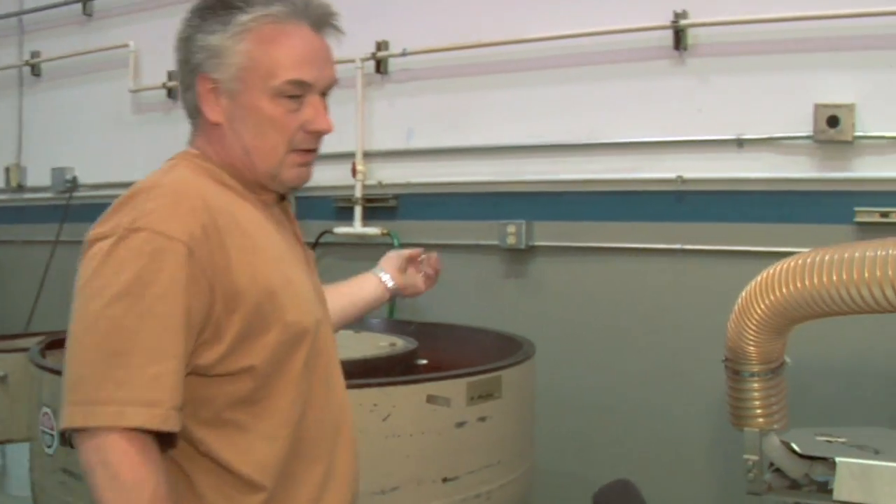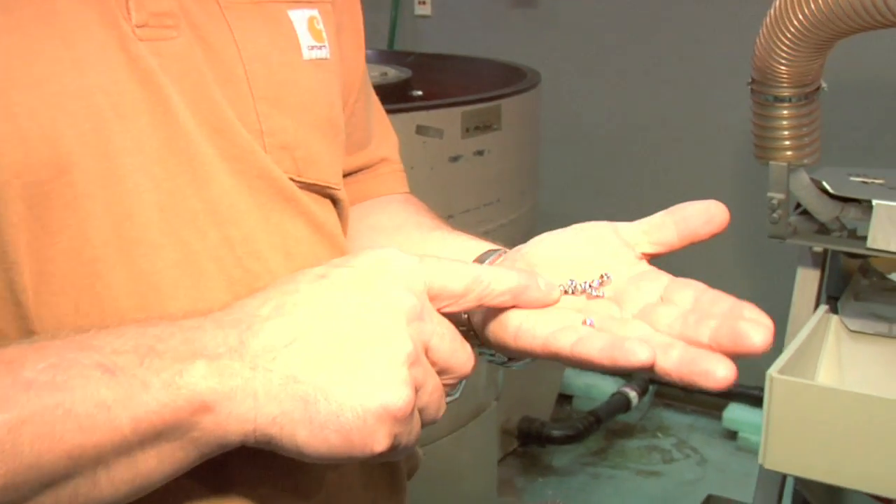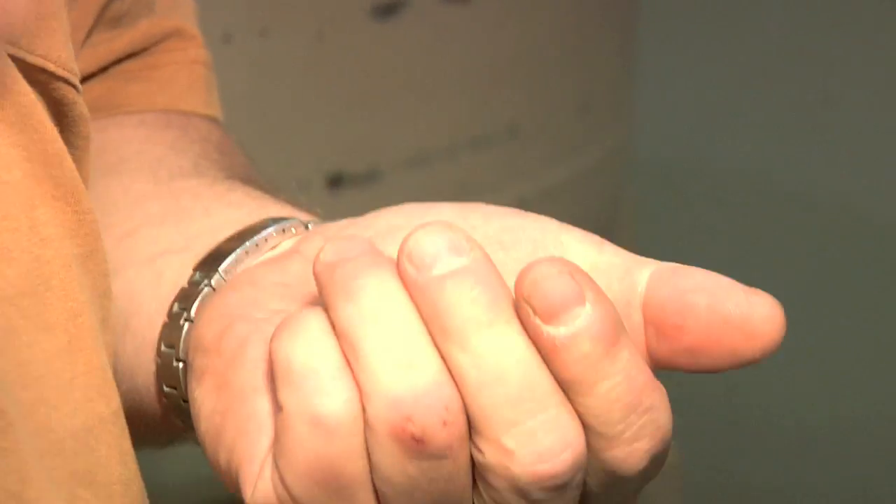The little beads are actually the polishing media. They use a 6mm ball and they call these a satellite. The satellites rub against the media, and by deburring and smoothing, the media makes the blanks shiny.